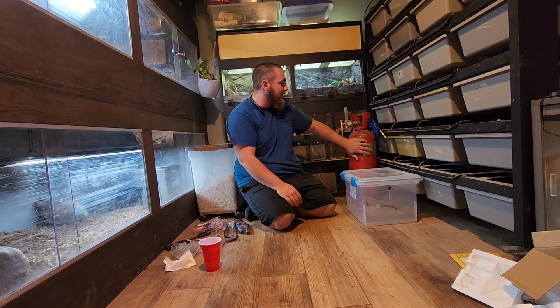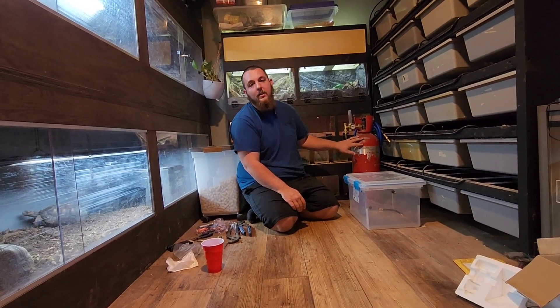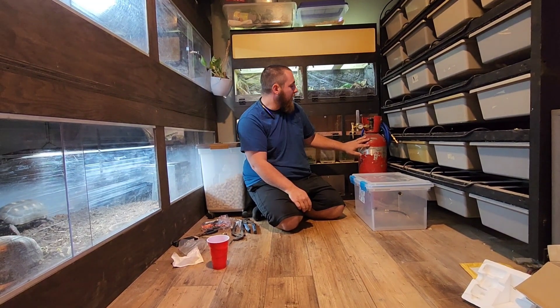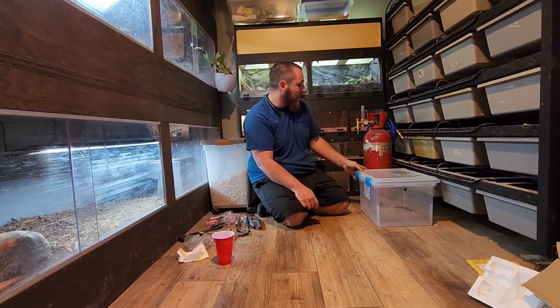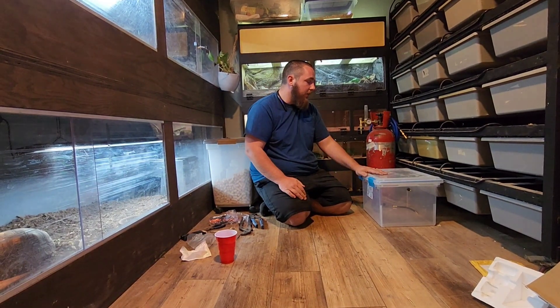Easy, quick, removable — a tank this size is going to last you quite a long time. One thing I'll tell you: if you take it to a welder shop to get it refilled, a lot of times they're going to offer to just swap it for you. If you're going to do that, I'd recommend taking my regulator and the fittings off first. And if you've got an old beat-up dirty tank, don't worry about painting it to make it look nice, because they may say they can't refill it but will swap you for a full one — and you'll get one back that has chips on it anyway.